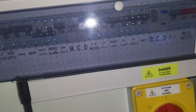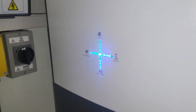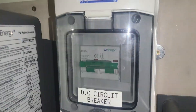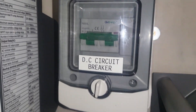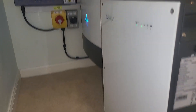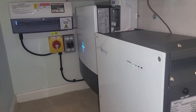We've got our isolation points under the consumer unit for both the AC and the DC. The GiveEnergy hybrid inverter has icons on the front to show you the direction of travel of the energy. We've got our DC MCB there — I have shortened down those DC cables and we've also installed a blank within that as well, so we've got that shortened up as far as possible. That is a wide-angle view of the finished installation.